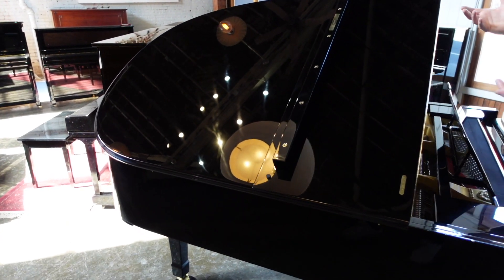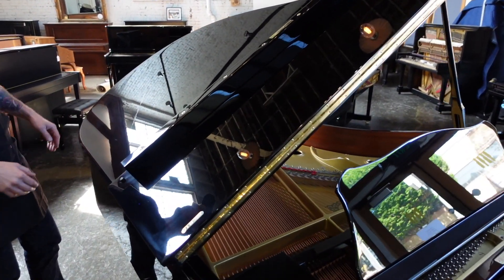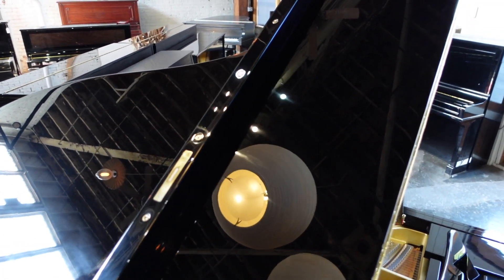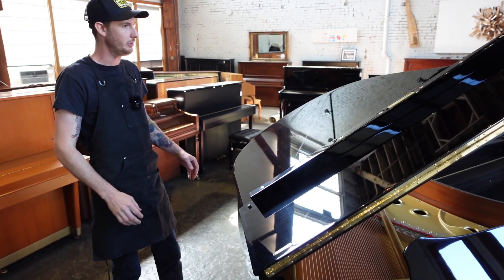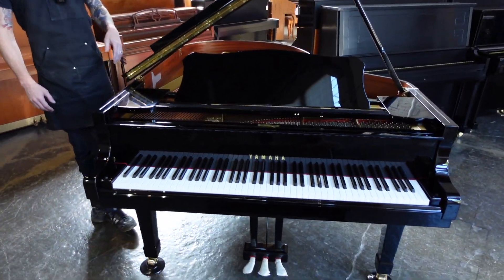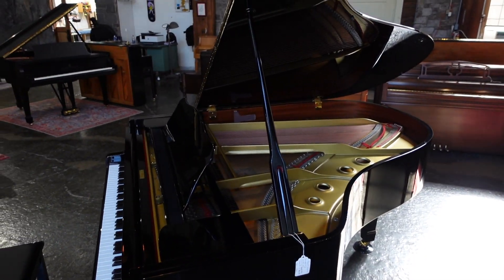We're able to service the finish, and we do quite a bit of this at our shop. In this case, in Japan, they probably wet sanded, and then after they wet sanded they went through a couple different stages of buffing, and they were able to get out all those major imperfections. Now looking at this, if you put the light directly on it, you can kind of see some marks where the buffer was on it, but you'll see that on a brand new finish too. Just approaching this piano and looking at it, seeing the brass hardware all shiny, and looking at every part of the finish — it is really indistinguishable from a brand new piano.